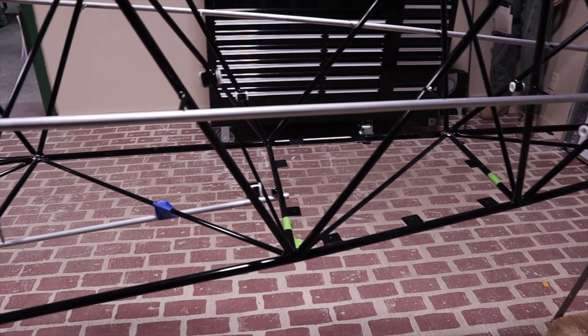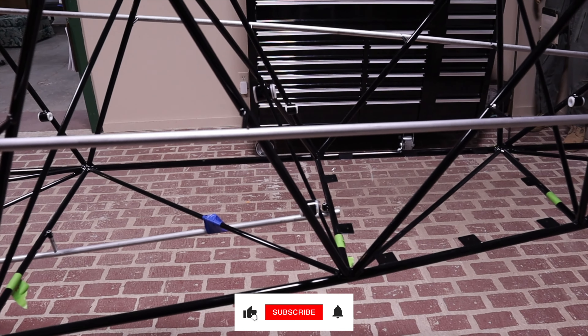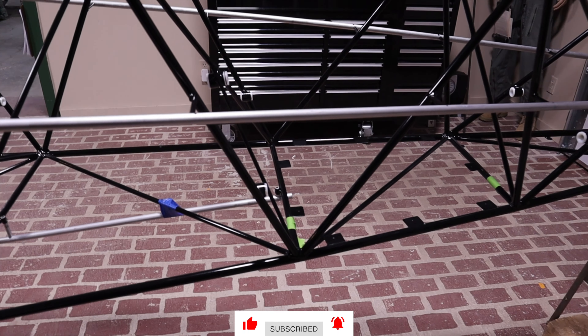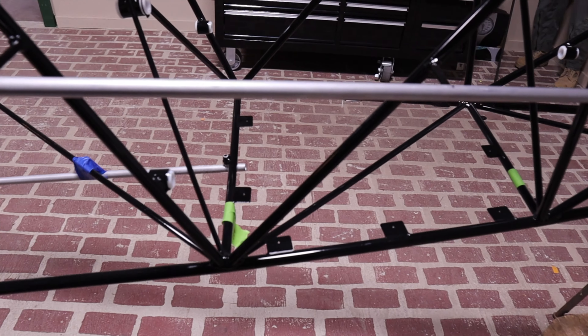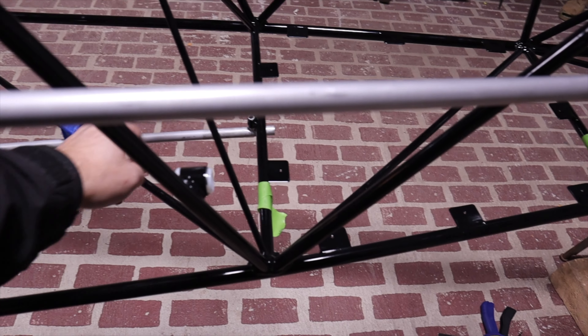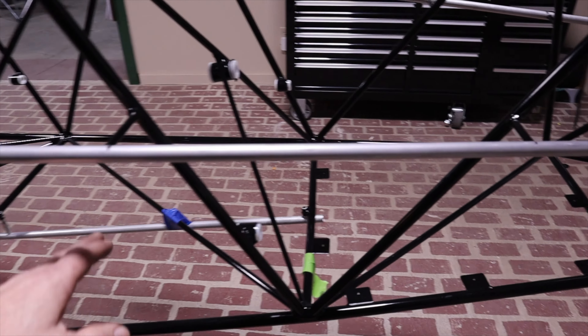The tail feathers just locked into place. Those wires with the turnbuckles are obviously temporary - I just use those to square everything up before I start putting the regular wires in. The turnbuckles really did work excellent; you just adjust here and there until everything is perfect. I did get lucky on the alignment of my elevator. I know a lot of people had issues with that, but it went perfectly on mine, so no problem.